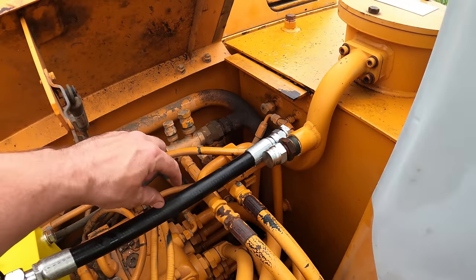But this side wasn't really detached or anything, but there was a very slight hairline crack going down, so I wanted to make sure it didn't get any worse. So again, I put this half inch plate here, welded all the way around. Like I said, those welds don't look great, but I'm also welding vertical and I'm trying to get used to the new welder. This is the old AC welder I was running,